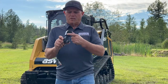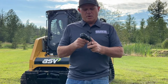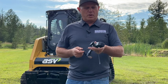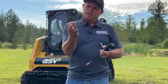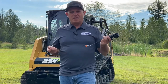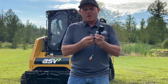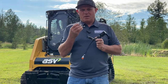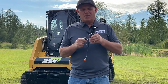The design of this — if you notice it's even curved — it's designed to go on your left stick because that's generally the thumb that's free to operate attachments. We put a RAM mount system on it, so we actually custom manufacture our own plastic housing to fit into a one inch RAM mount ball system. We have their mount kit — it's got a little U-bolt on here. The U-bolt goes in and will hold it on your stick. Now it's not going to fit every stick that's out there, so if you've got a bigger handle you can take this little adapter out and put it in. If it's still not big enough, this has slots in it — you can buy other ones at your local hardware store that might be a little bit bigger, a little wider.